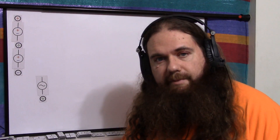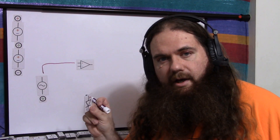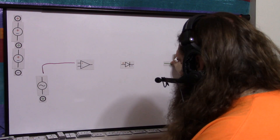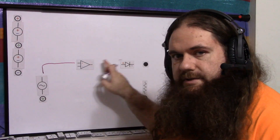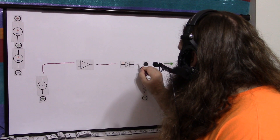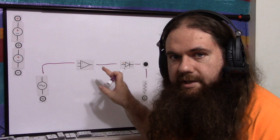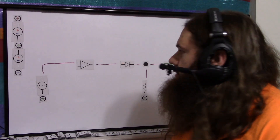Now it's time for the ever-magical op-amp. We give our voltage to the op-amp, but we still need a diode because the op-amp is not a diode — it's going to manage the diode. So there's the diode, and we have our output relative to ground. We add a resistor, also grounded, and this gives the op-amp a path to control the voltage: op-amp output, through the diode, through the resistor, to ground. Because the diode only ever has a static drop, we need the resistor in this path to control the output voltage, and in fact this is our negative feedback.